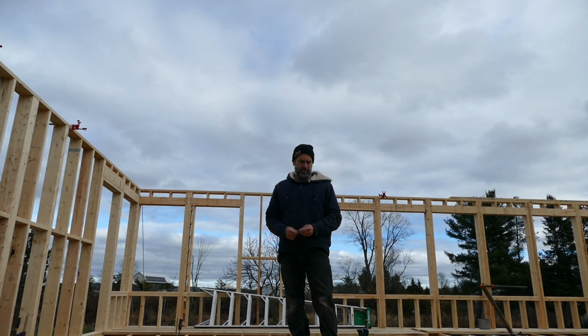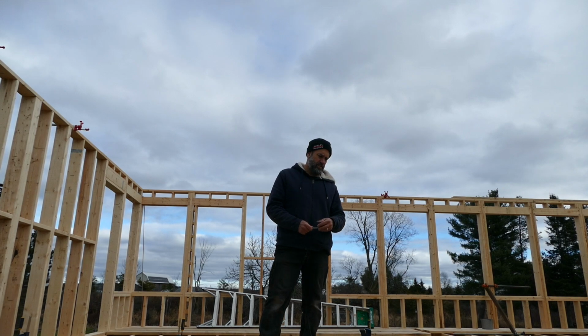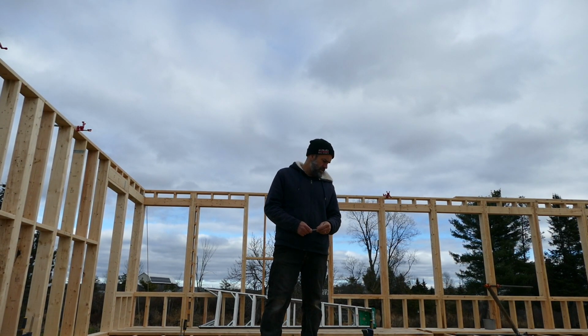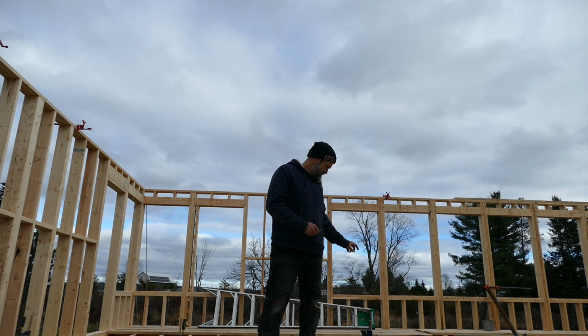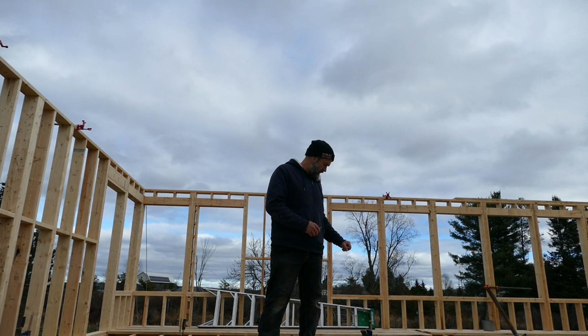I noticed with the first beam that we put together, it's a little bit bowed, just a little wee bit. So what I've done is nailed it in at the bottom with 6 4-inch spikes, and then 3 10-inch timber lock screws. So that's on for life.